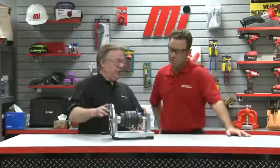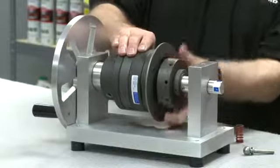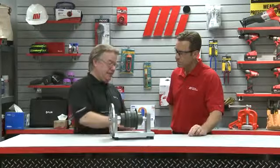Can you show us how that works? Sure. If you look at the 400 series, you can see the springs inside the adjusting nut. If you need to increase or decrease the torque settings, simply tighten or loosen the adjusting nut — you're compressing the spring or letting the spring come out. If you need a more aggressive setting, you can always add or remove springs. This can be done while the unit is still installed. Simply make your changes and you are ready to resume production.